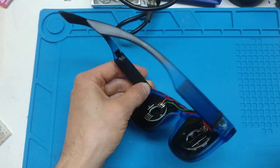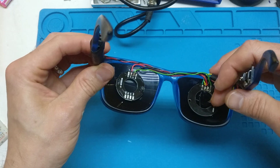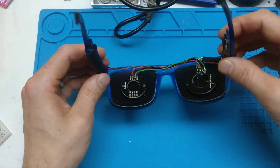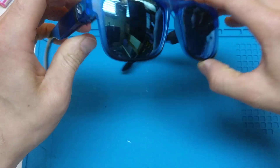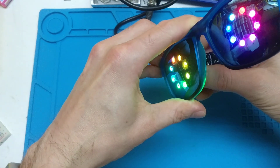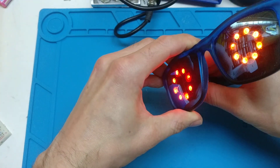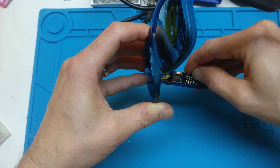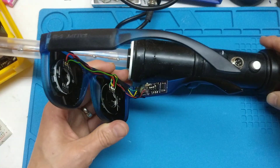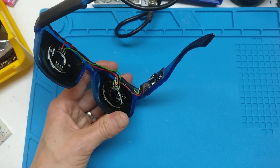What you have to do is drill a hole for the choke to come out of, then basically just wire the wires across. Hot-glued the WS-2812s to the front, superglued the wires in place so once it's on the front they'd be out of the way. I'll show you the different modes — these are just the DIP switches. I realised I could have used fewer DIP switches and used them in a binary fashion. There's a nice rainbow mode, and then the chase ones — basically the same code I used in this project. The reason I used four DIP switches is because you can only have one switch on at once.